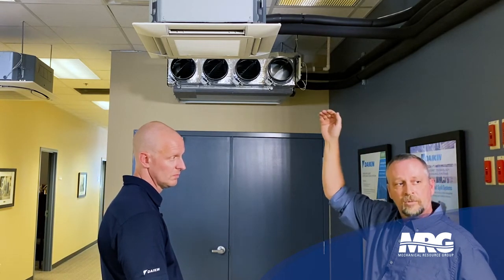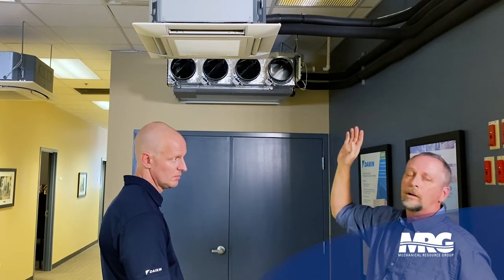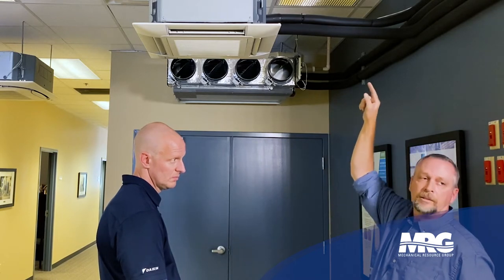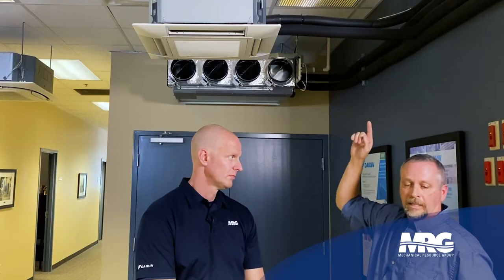If you don't follow these rules and you run that vertical too high, the pump's going to come on when the unit calls for cooling and it'll pump that water out — that's fine. But as soon as it satisfies and the pump shuts off, all that water in that high riser is going to flood back into your pan inside the unit, make the float switch, and you're going to get either an A3 or an AF error code. When you look that up, it tells you you've got water in your pan. So it's super critical to follow those guidelines. Every indoor unit comes with that in the IOM that ships with it — so be sure when you're installing, follow those rules and don't throw that paperwork away.